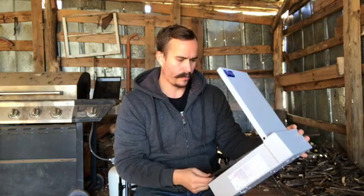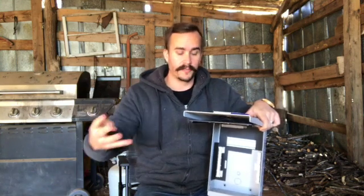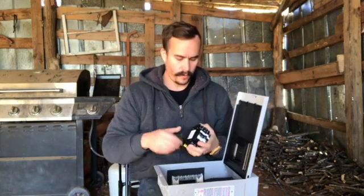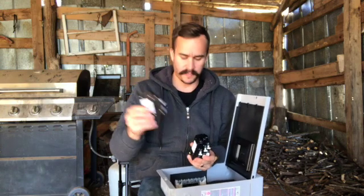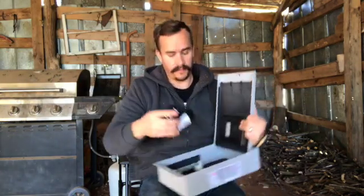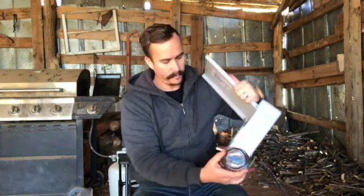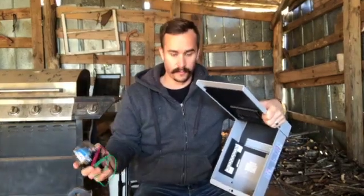All right, so we're working on setting up this combiner box. This is the Midnight Solar MNPV6, and basically a combiner box is like a DC panel box. Our panels will be wired in series of 3 panels, and that means there will be 4 series. The 4 series will come into each of these DC breakers. The positive will come into the breakers, which will be mounted here, and that will combine it into a single DC output, which will be the wire that we already buried under the ground, running out of here. Basically, a combiner box just consolidates all those wires from the panels into a single output, sending it to the charge controller. So I'm going to set this up and get the DC breakers mounted. We also have a surge suppressor that will be mounted here, and then we'll mount it outside underneath the solar panels and connect it all.